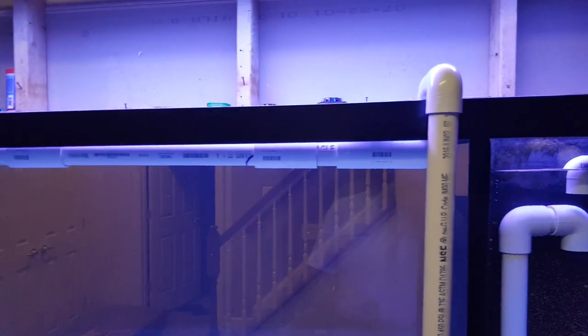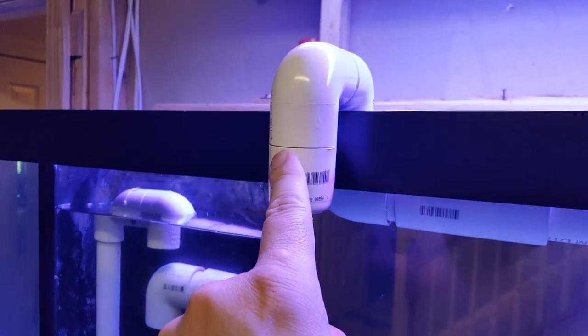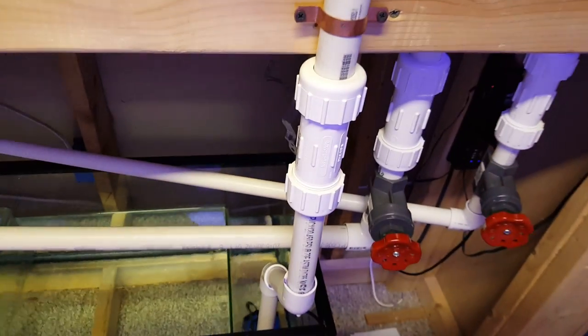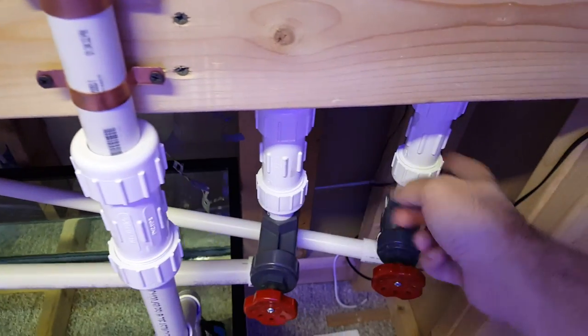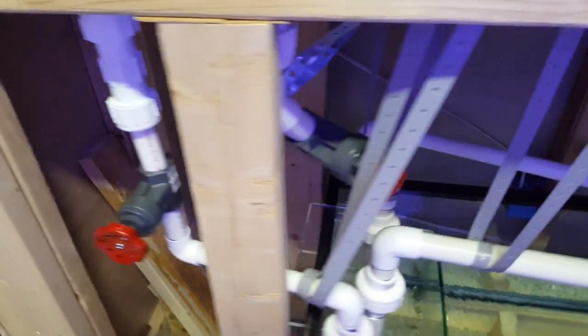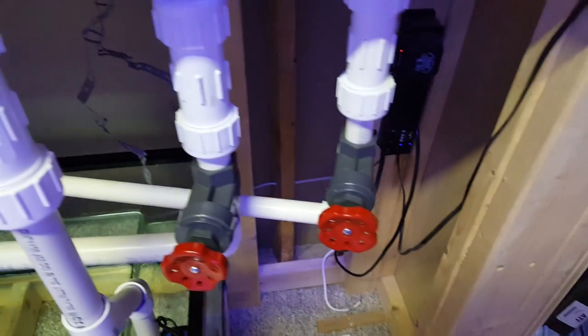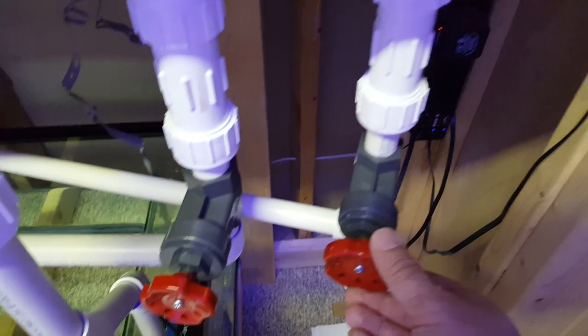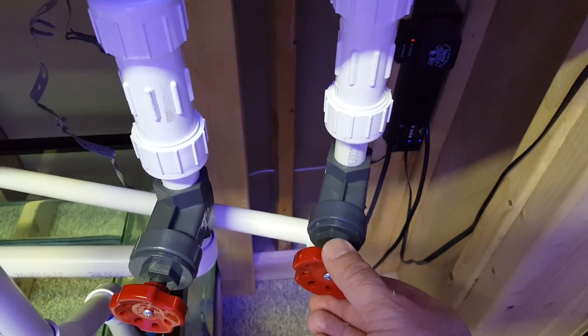The return is over the back. I've used a simple one-inch PVC pipe, capped off and over the top. This is your feed pipe. These compression fittings are my new favorite connectors — they let you rotate the plumbing within the fitting, which is very nice. I do have a valve on every line: for the larger one it's to tune the full siphon, and for the smaller one it's simply to shut it off for maintenance.